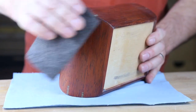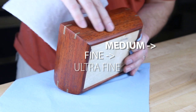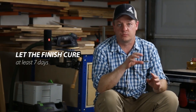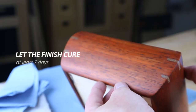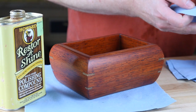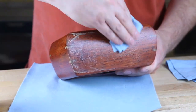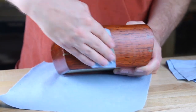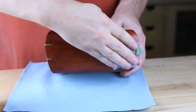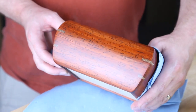Since scuffing really kills the sheen, I use a polish to bring it back to a semi-gloss shine. I work with synthetic finishing pads going from a medium to a fine pad — that smooths out the finish, removes scratches, and almost brings the sheen back to where I want it. But to go all the way I use a liquid polishing compound. It's really important not to jump into polishing right away — you want to wait like seven to ten days to let the finish really harden up. The harder it is, the better it'll polish. I waited seven days. With a blue disposable shop towel, I apply a little and swirl it on for a minute or two, then work with the grain back and forth, grab a fresh towel, and give it a nice buff — one side at a time. It might take two or three applications on each area to bring back the sheen to right where you want it, but it's really well worth it.